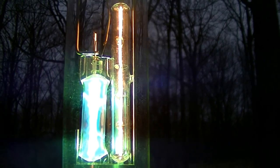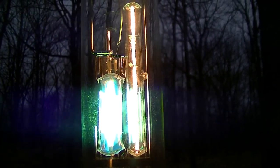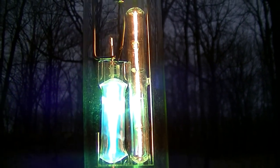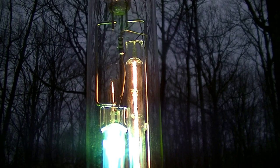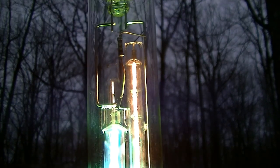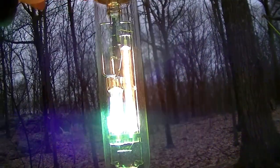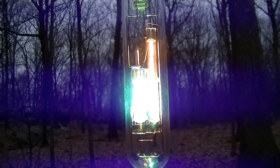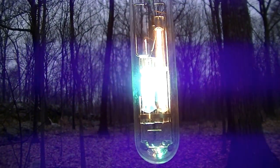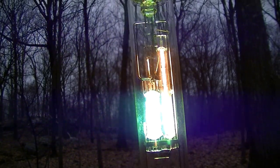And by the time halogen lamps had gotten cheap, or relatively speaking, blended mercury lamps were kind of an obsolescent technology — because you could get comparable service lives with much greater luminous efficacies out of fluorescent and especially compact fluorescent, once that had been developed, with the added benefit of instant re-strike. These things take a couple of minutes for the discharge tube to cool down enough for the arc to re-strike.